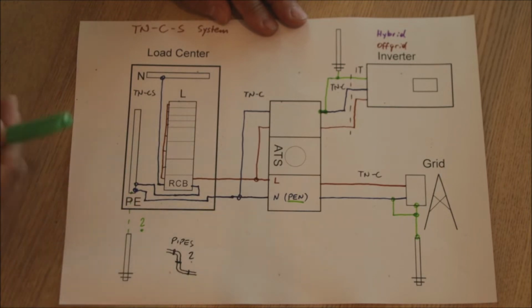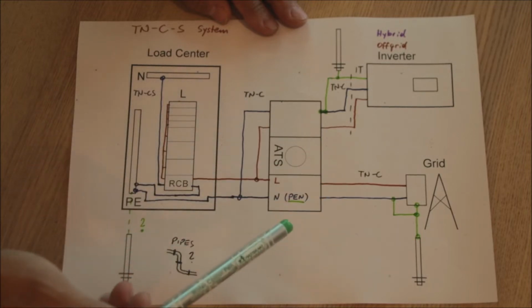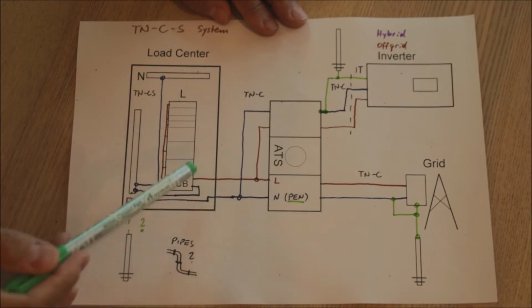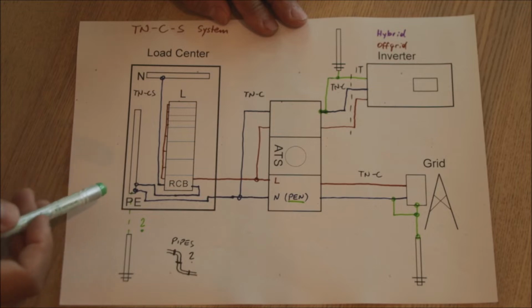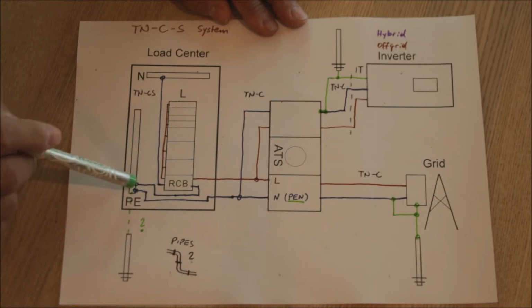These alternate earthing points are very common. They're actually necessary in many cases because with the TN-C system there's one risk. When the PEN conductor is broken somewhere and the live conductor is still intact, the return path of the electricity is broken and the whole system beyond the break is actually set to a high potential. Because that can be a dangerous situation, these alternate earthing points are common and also sometimes mandatory, because in the case of a broken PEN somewhere on the utility side, they can then pull down your neutral conductors to ground.